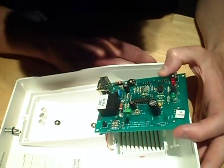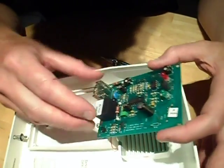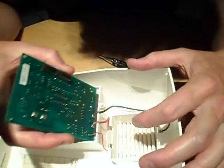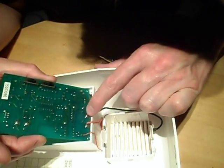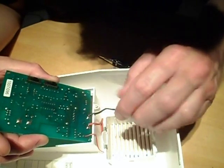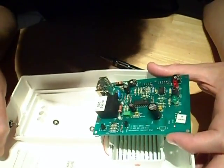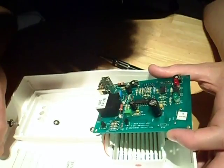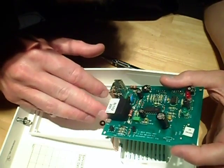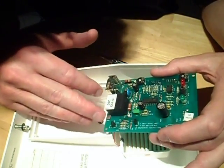The PCB looks quite simple actually, slightly old-fashioned. There's the high voltage transformer and its drive transistor. The high voltage transformer is directly referenced to the negative rail on one side, and the output goes straight to the ozone plate. There are five connections in the primary, though I don't see too many connections coming from that. There are also some pads here — I wonder if that's for testing purposes or as an alternative connection point for the output leads.